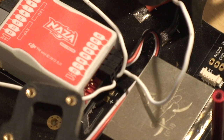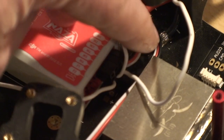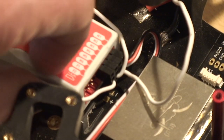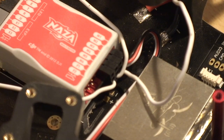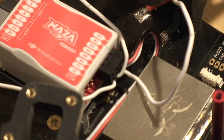Just a little word about the cables coming off the ESC controllers. On some videos I watched, all the ESCs seem to have a three-cable strand, and some have only got one white cable. Doing a bit of reading about it, it turns out one of them has this ESC controller link or power connection, and you don't need three cables on all of the ESCs — just on the one, if you're going to do some calibration.